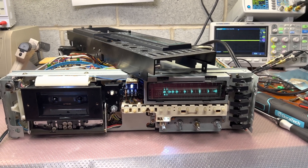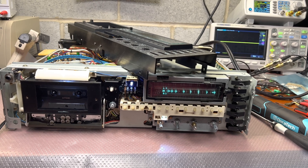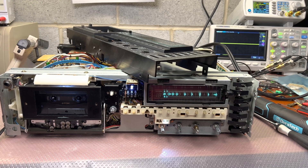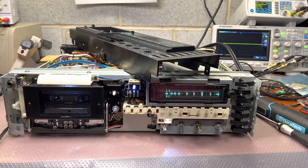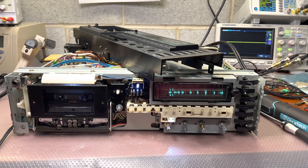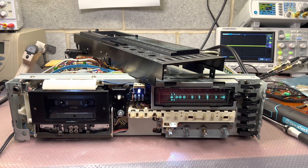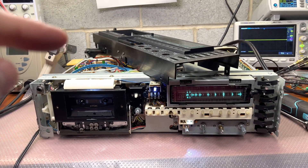So from one side, when you're listening to modern decks, you can hear better high frequencies — the coil will pass through more high frequencies. Plus, that bias noise may provide some additional coloration. When you listen to these older decks, they sound very natural and musical because they produce a clean sinusoidal signal. That's the difference. My Akai 9100 and Sony decks have no coils at all to filter the bias — the filter is done differently. That's why they sound the most clear. But I like how the 680 sounds — it's very musical.